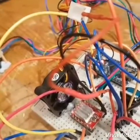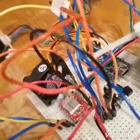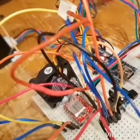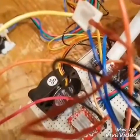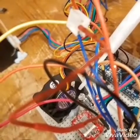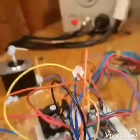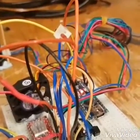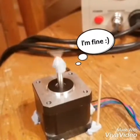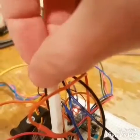I've bridged sleep and reset. I've also put a little fan on just to keep it cool off the 12V. The 12V is bridged off of the regulator and goes up to the two top-most right pins where that capacitor is, to power the actual motor — so it's got 12V to drive the motor. That capacitor is just to stop any kickback voltage from the motor hurting the board. I put a bit of code on there which sends pulses for one full revolution forwards, one full revolution backwards — and it works! It's quite a good little screwdriver for the trim pot.